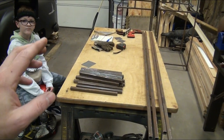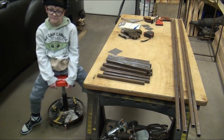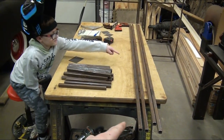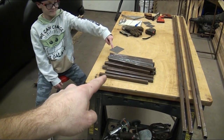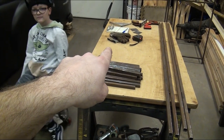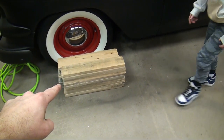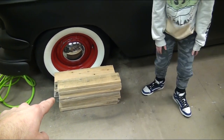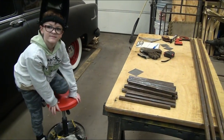So we are going to make two sets of vertical shelves. These long pieces right here are going to be the verticals. These pieces we're going to weld to the back of that and they're going to go from the vertical piece back towards the wall. Then that pallet wood that we cut is going to sit on top of the shelves and we'll screw that to the shelves with some self-tapping screws.